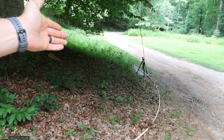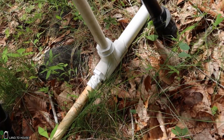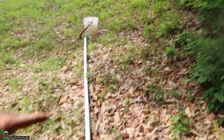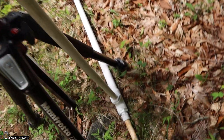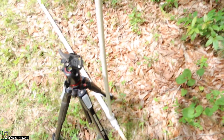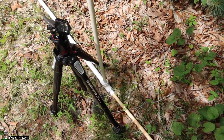In my case, a half-inch pump needs half-inch pipe. So let me show you what it looks like to install bigger pipe, standpipe, then drive pipe. I've got a one-inch T that reduces down to a half-inch standpipe, and that of course rises up above the source level. From there it cuts down to half-inch, and that's your drive pipe that goes however far to your pump. That right there would allow you to reduce down from a bigger pipe to the required drive pipe size.